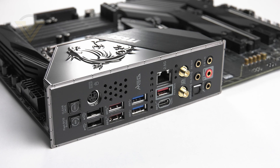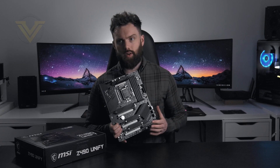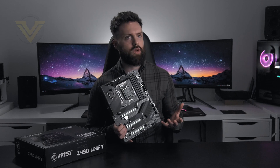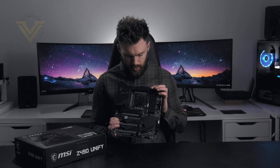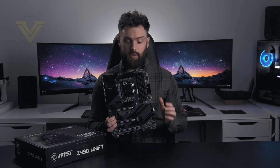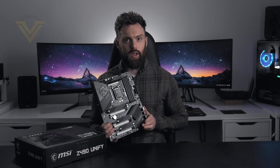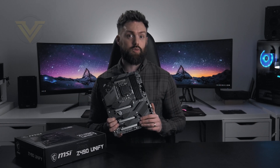Interestingly, the Mini-ITX version of Unify sports Thunderbolt 3 instead of the 2x2. With Unify we get a load of diagnostic features — those types of elements aren't necessary for all users, but they're handy if you like to troubleshoot your board when issues arise. It's also interesting to see a rather robust VRM configuration with 8+8 pin at the top. In our web review, which will be going up once the CPU embargo lifts, we'll be checking out how well this performs in terms of overclocking ability. For all those benchmarks, be sure to check out the link on screen and in the description.